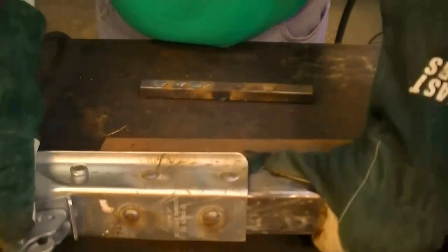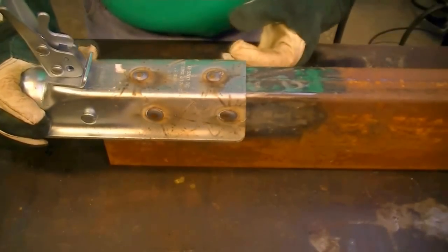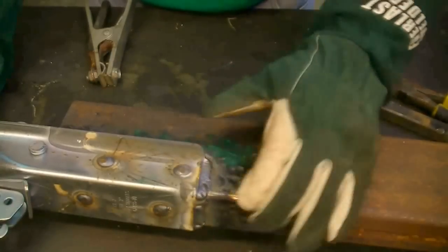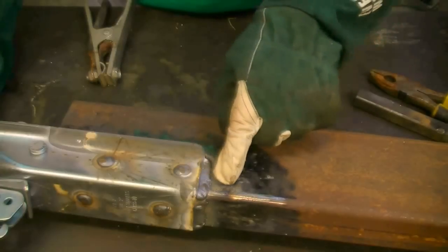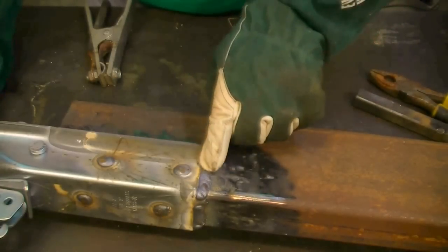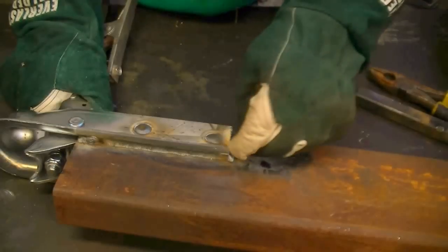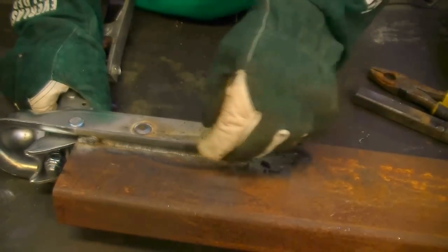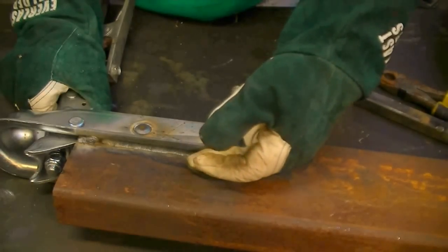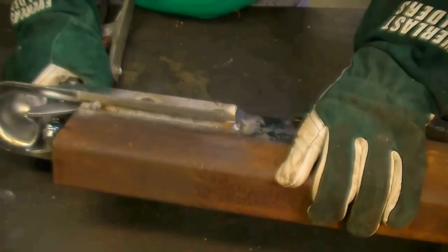We've completed the plug welding process. We're going to weld down the seam on the sides and along the bottom. We've finished the plug welding and welding the coupler up around the edges — you can see we filled right to the edge, didn't overflow onto the top, and it's flush and even. We finished the seam on the bottom side as well, and you can see it doesn't have to be wide — it just needs to have good bonding between the coupler and the base metal, and that's what we've got.